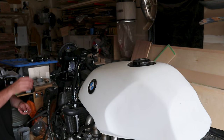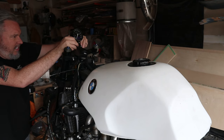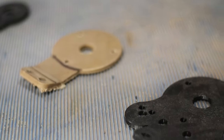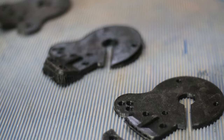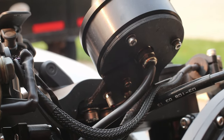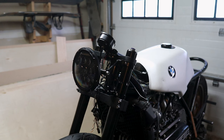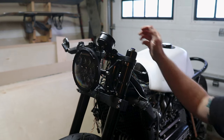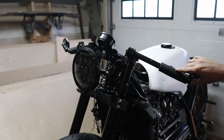After a bit of playing around, I realized what I built was garbage. I ended up going back to some other mounts I had and just 3D printed a bracket based 100% on the bracket that Jack's offers. I know this isn't a permanent solution — 3D printed parts do work, but this one does have some flex. It's PETG, which is more designed for outdoors. As you can see, I did have to reprint the final version with 100% infill because it actually snapped while I was riding since I didn't use enough infill. It's definitely something I'll continue to iterate on — let me know in the comments if you have more questions about this bracket.